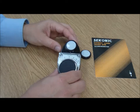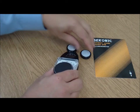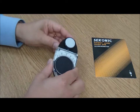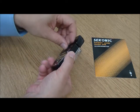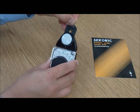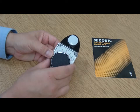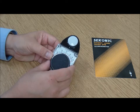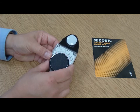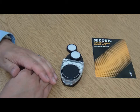If I was going to go outside, I would switch back to the lens assembly and, so as not to burn out my device, use an additional filter tool, using the outside numbers and then multiply that number by 10 in order to get the higher rating for direct sunlight. And that's how you use an illuminometer light meter.